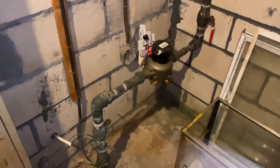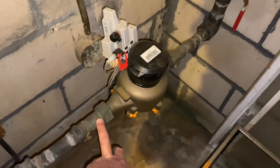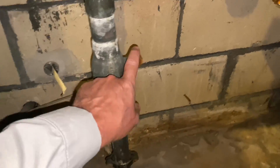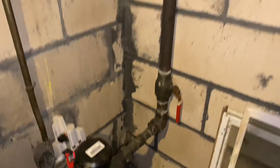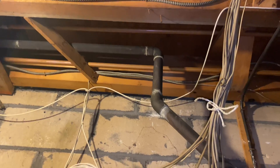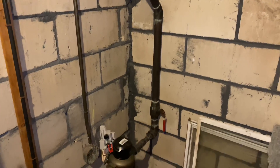All right Peter, we have an inch-and-a-quarter water meter with inch-and-a-half water service. This valve is no bueno. We have an inch-and-a-half water main and we've got to put in a double check valve here. To comply with code, you need a backflow prevention device on the water main.